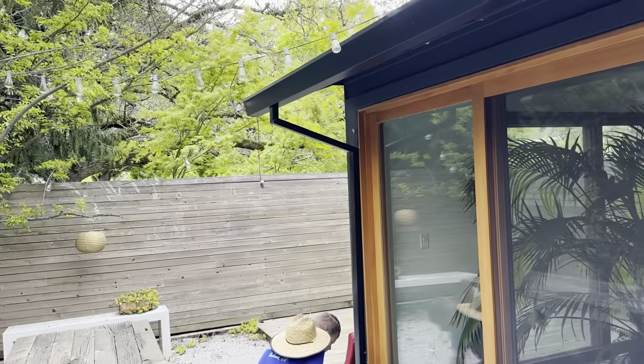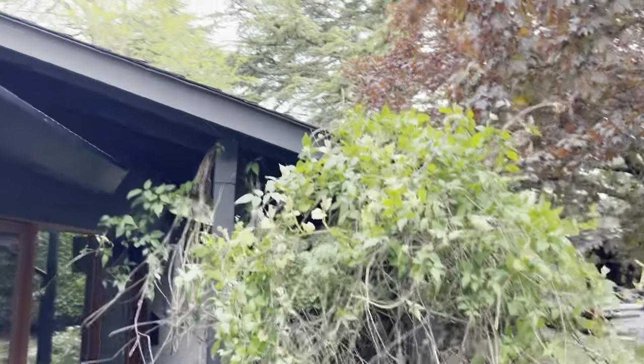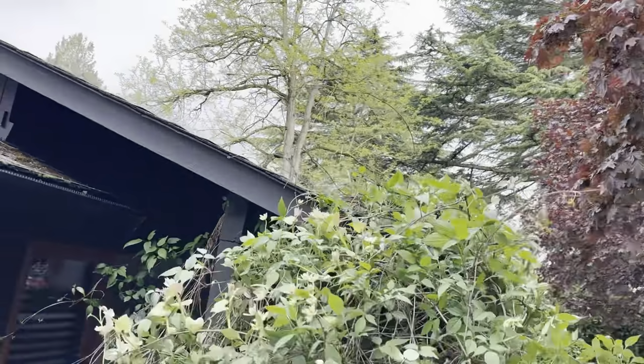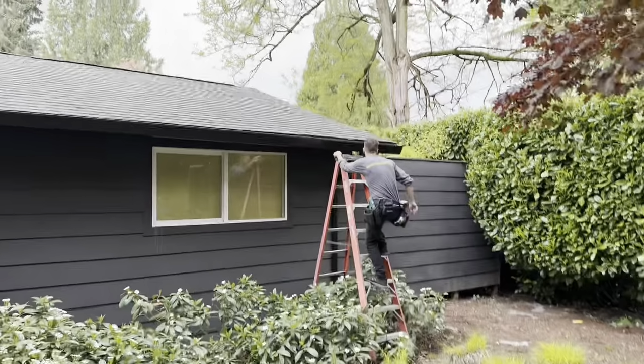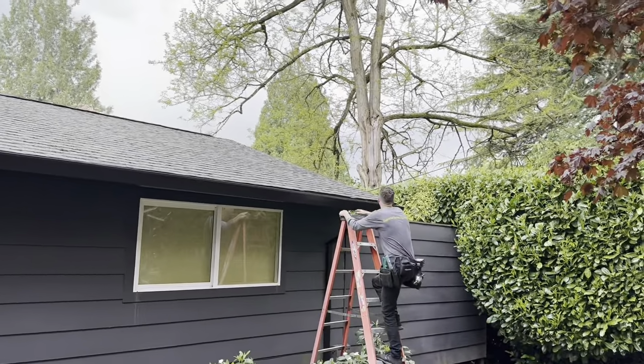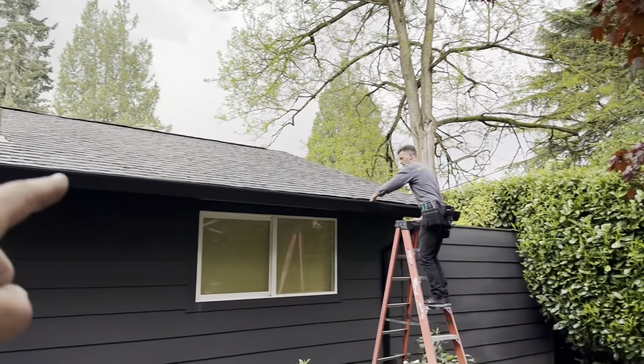All right, this downspout, I made a little bit less slope. It's the only one that there's gonna be foot traffic. Put the flowers back on the gutter. And this one is looking good. Turned out nice. We added some skirt flashing right there where we lowered the gutter just a tiny bit.